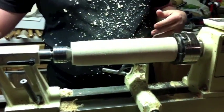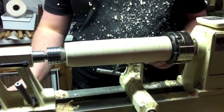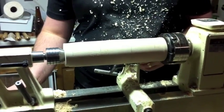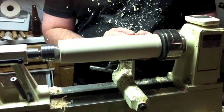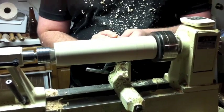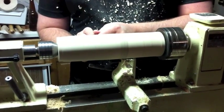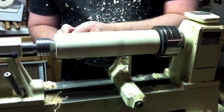To mark those so that I actually have some nice, easy ways to see them, I just turn on the lathe, put my pencil on those marks, and we can see them all the way around. So there's the bottom, the middle of the cove, kind of the high point, the beginning of the neck, and the top.